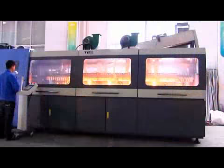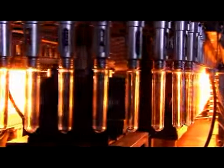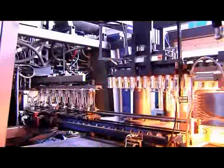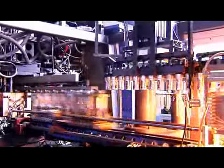The super small mandrel pitch makes the EB series consume less power. Efficient oven cooling and cross ventilation systems prevent crystallization even for very thick preform walls. A servo motor driven variable pitch system synchronizes with the preform materials, reducing the time of preform transfer and ensuring reliable variable pitch changing.